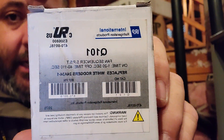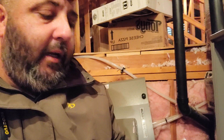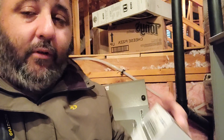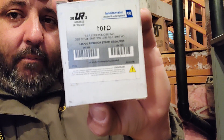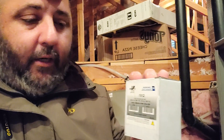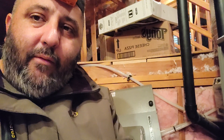Here's the part I'm using — if you want to look it up, it's a Q101. It's called a fan sequencer. I used to call them heat sequencers because they're really only used for the heater. Some systems will have two: one for the air conditioner and one for the heater, but most older systems have this for the heater and just a time delay for the air conditioner. Hope you enjoy the video — smash that like and subscribe, we'll see you on the next one.